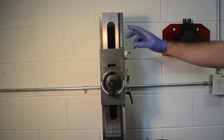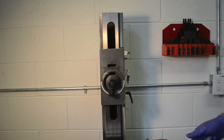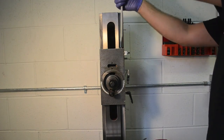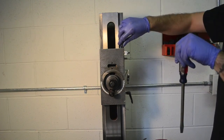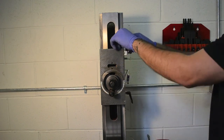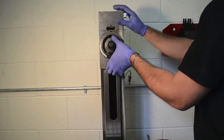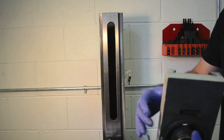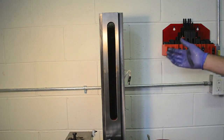Next I'm going to take the actual Z-axis carriage out. I'm just going to loosen up — I've got this guy here holding it down, so I'll loosen that up and should be able to just slide it straight out the top. Let's take the gib out. I'm just going to take this skirt out here. That's all loosened up, so that'll be easy. And it just comes right up. We'll take the gib plate out of there and put that down on the table.